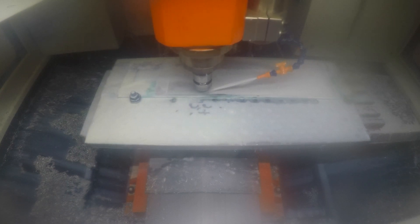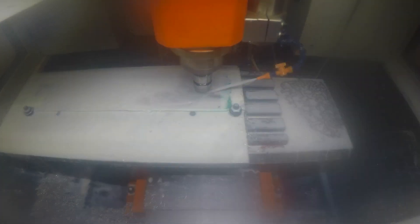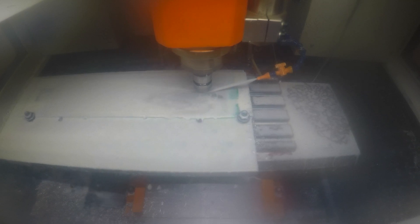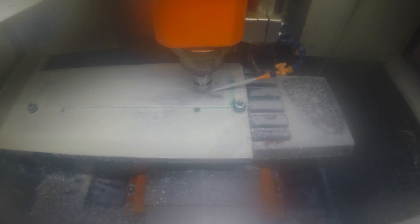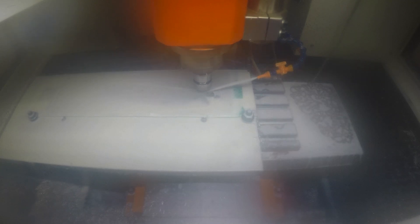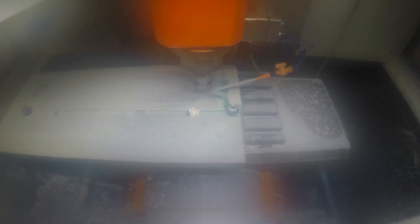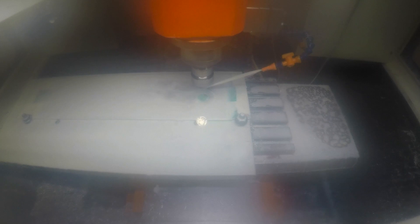Here's it doing the drilling, which is more interesting — these move real fast. You'll notice the fuzziness over there; I talked about air blades for the Tesla Cybertruck — I need air blades on my cameras, so sorry for that. Here we're giving you the slowness of the slotting. Here's it slotting — that's a big circle. I'm not going to make you sit through it; it took like a minute per hole because I did not optimize this tool path at all — it's just the world's worst helical plunge, just took forever. It was like almost a minute per hole — just stupid. You can see the actual center piece came out — just no glue holding it down. The part didn't move, but that little center piece that we cut out did. Once we're done there, we switch over to the chamfer. I don't know if you noticed a little bird nest there — the eighth-inch bit did not break, but it had a big old bird nest on it, kind of crazy. Again, you can get an idea how way too passive I was with the helical into these contours — I was just dumb.